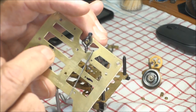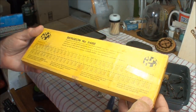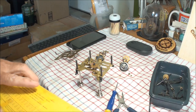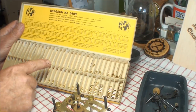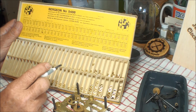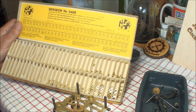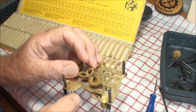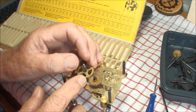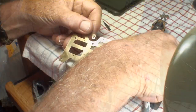This is the one I'm going to start on. I have a bunch of these bushings, and now I need to figure out what size of bushing I need. I go through and look for the shortest one — we do have taller ones too depending on your movement. I also try to find one that's going to fit over the hole as needed. Here you can see it fits over nicely, so that's the one I'm going to select.